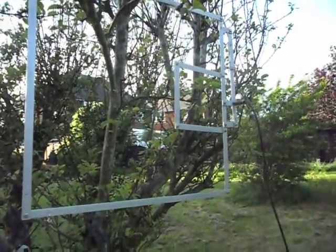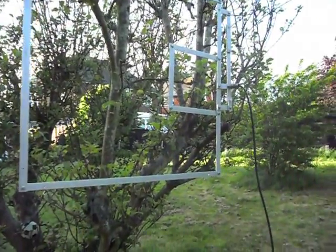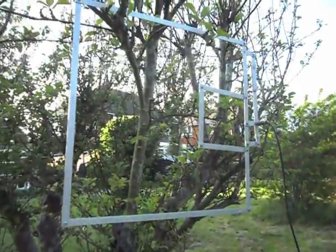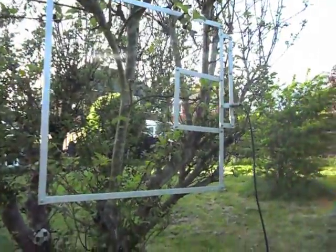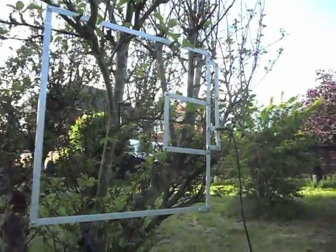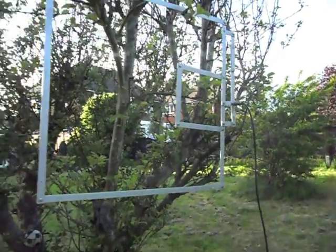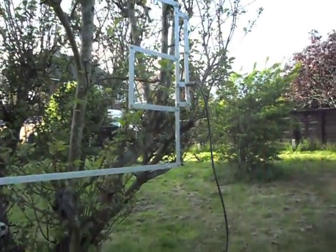So that's a Belgian station calling, and a Northern Ireland foundation station — that didn't really work very well. I was trying to demonstrate the node in action, but anyway: if you are very close to Ferring in West Sussex, 144.9625 MHz is the frequency you need, with a CTCSS access tone of 88.5 Hz, and away you go. I hope this video is of interest demonstrating the new link on the West Sussex coast — MB7ISC.